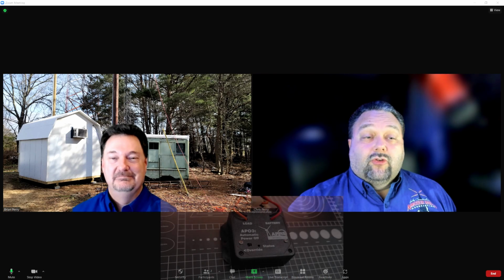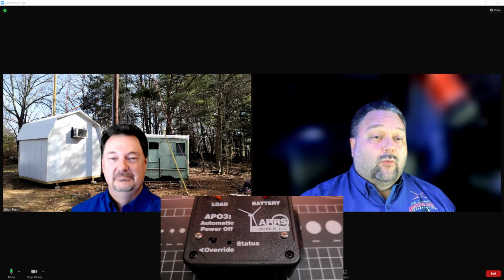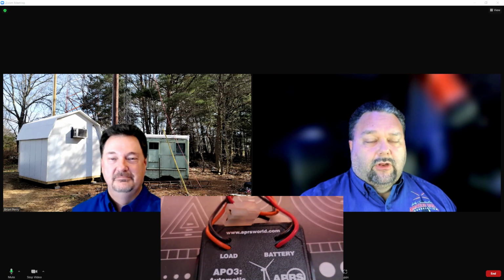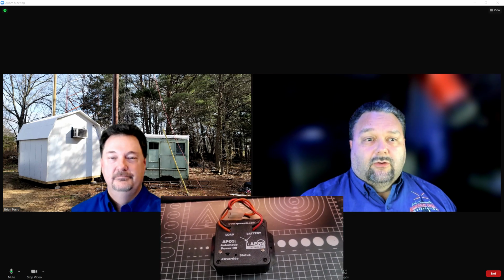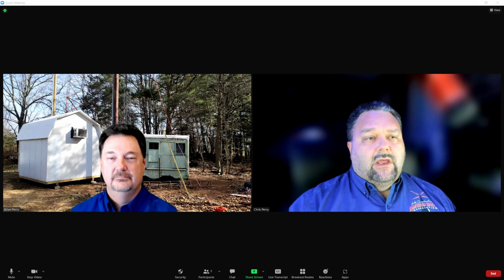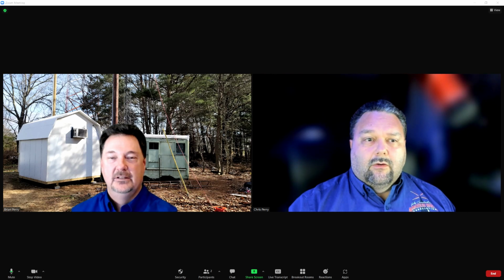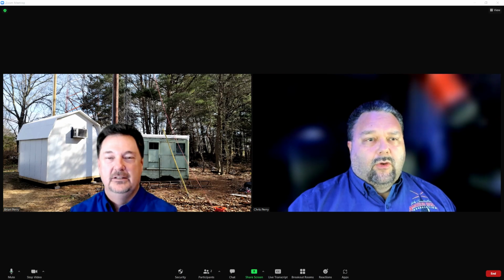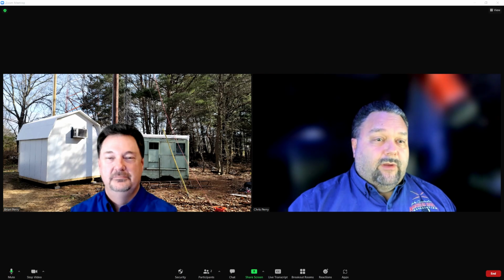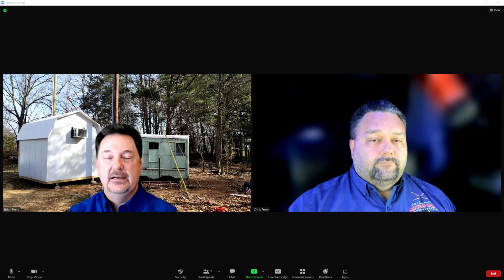Right, and the commercial unit that I purchased, I think over 2 years ago now, it's been a good while at least, can come in one of three configurations, which you could build your unit in any of these three configurations as well, and that would be plain bare wires, Anderson connectors, or the T connectors for typical mobile radios. So when I bought mine, I went ahead and got it with the T connectors just to connect it straight to what was already on the radio. A lot of people will cut off those T connectors, put on Anderson connectors, and you could certainly go that route. And with the units that our club built, I think most people were putting the Andersons as a connector for the unit. Exactly.